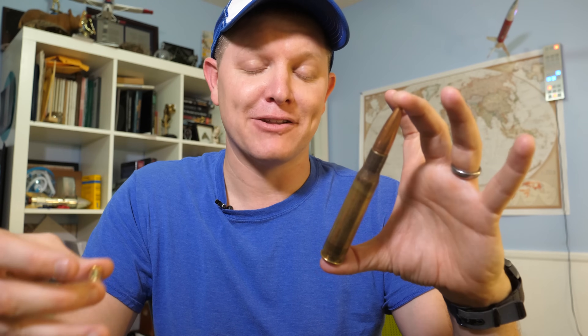This is what I honestly think is going on here. Stress is equal to force divided by area. As the force is distributed over a wider and wider area as it goes down through the acrylic, you eventually get to the point with a 9mm where it no longer has the ability to fracture the acrylic — the stress isn't high enough. However, a 50 cal would definitely do that because there's a much larger pressure cone. It gets further through the material and eventually we get to the part where it'll just break out the back.